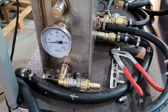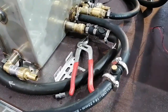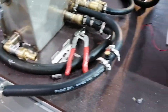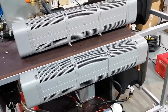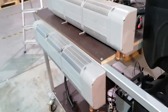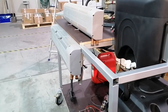We have changed our warm water circuit that comes from the heater. Previously it was going through the heat exchanger and then going to the boiler, but now we have connected it directly to the boiler. We'll be using two separate connections and an external water pump for these other two heat exchangers. With this done, we will connect the hoses and hook everything up electrically to the system so we can switch the fans and the pump on or off.